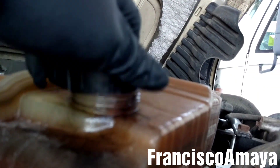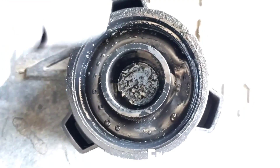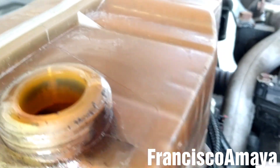You can see there is a lot of fuel coming down to the frame. You can see the cap over here — there are a lot of fuel marks on the coolant cap. See the seal? It is all messed up. So there is fuel in the coolant. It is really hard to see it, but there is the fuel. You can see the drops over here. They are pure fuel and it smells like fuel.